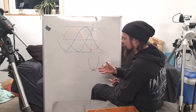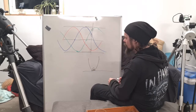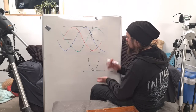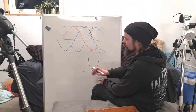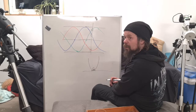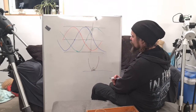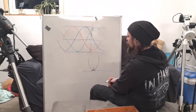It's going to look at how the mount axle is moving, and then it's going to adjust the magnetic field to keep the mount where it's supposed to be, or moving at the speed it's supposed to be. Yeah, that's it. I could increase the strength of the magnetic field. That would pretty much be like having a heavier ball or a stronger gravity, whichever is more convenient to you. That would basically mean that you would require more force to move it around the bottom. Yeah, and it would resist moving up the edges of the cup a lot more.